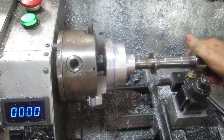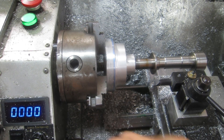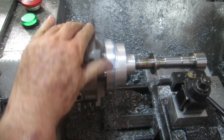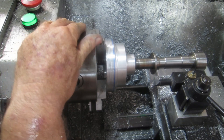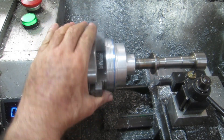So I've got that finished - bored it and got a nice fit in there. It's a little loose but it'll be okay. Had a minor problem when I was parting the front off here - tore it out of the bloody chuck, threw it on the floor, put a ding in it. So I'll have to turn it back around the other way again and just fix that up. Not any major damage - a couple of dings in other places but I don't think it's too bad anywhere else. I'm gonna have to fix that up though.